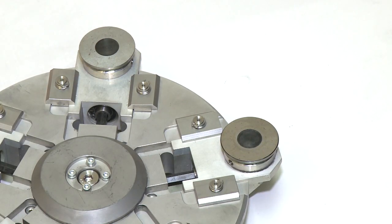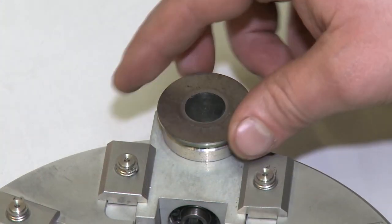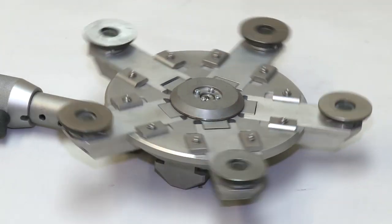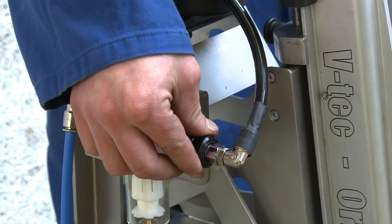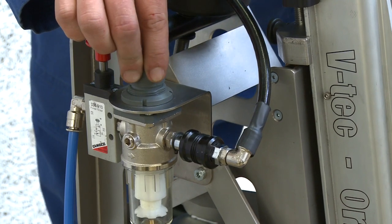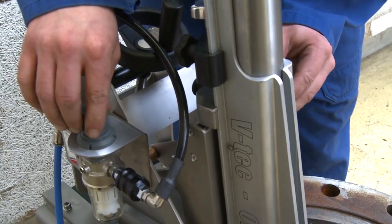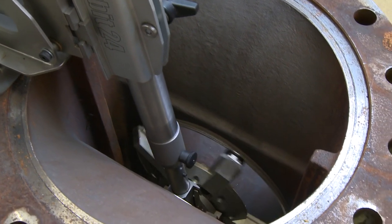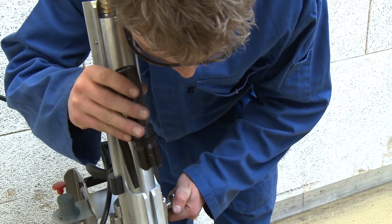The advantages of the unique orbital gear driven grinding and lapping technology are: it produces the perfectly flat crosshatch machining pattern. The five grinding discs rotate at exactly the same speed across the complete sealing face. As the grinding discs are mechanically driven, the material removal rate is much higher than conventional friction driven grinders. There is no need for very accurate and time consuming diametrical adjustment to the sealing face as needed with conventional machines.